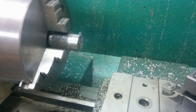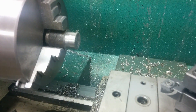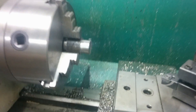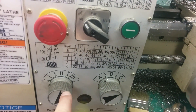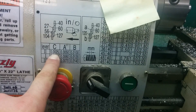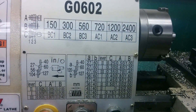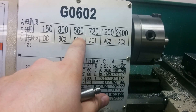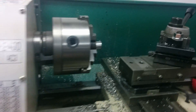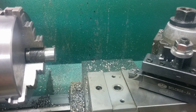I successfully cut two hundred thousandths — 0.200 inches depth of cut. I was running at 2.5 thou per rev at 300 RPM, because at 560 RPM I didn't seem to have enough torque. I ran a little slower than needed because the motor kept bogging down.